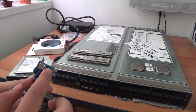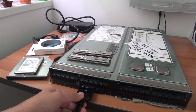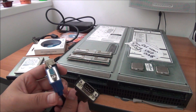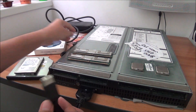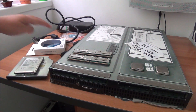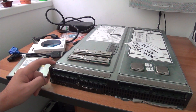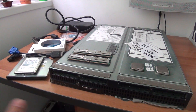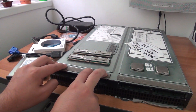It doesn't even have VGA out — look at this weird connector. This front unit has only two USBs, so this is where a USB hub comes in, plugged into one of them, and everything USB will go through that. It also doesn't have a PSU internally — this thing was meant to go into racks and connect to other boards that gave it all the voltage and current. So I'm going to try and modify it to work as a standalone computer, just to see if I can do it.